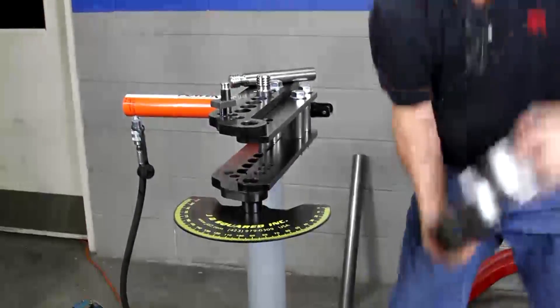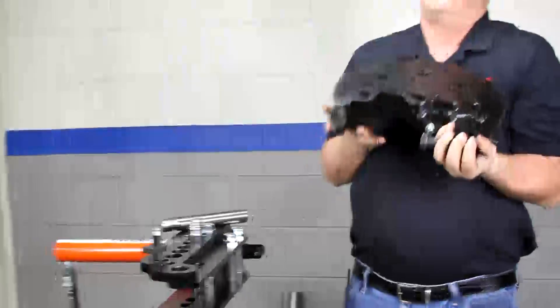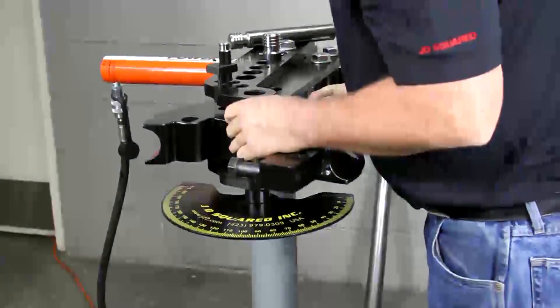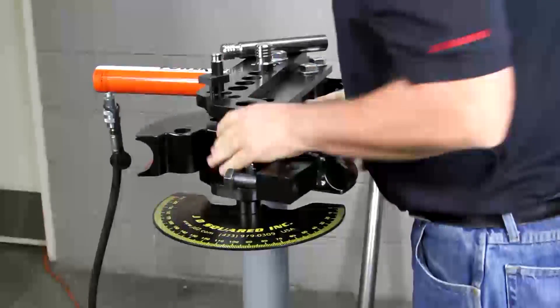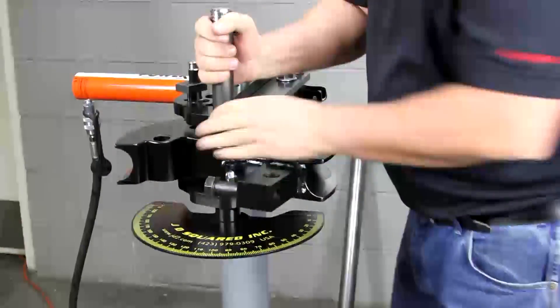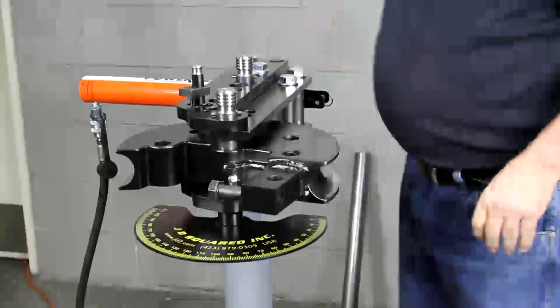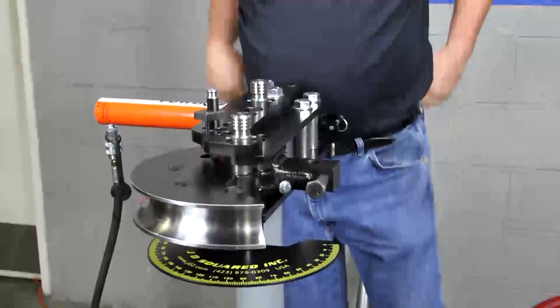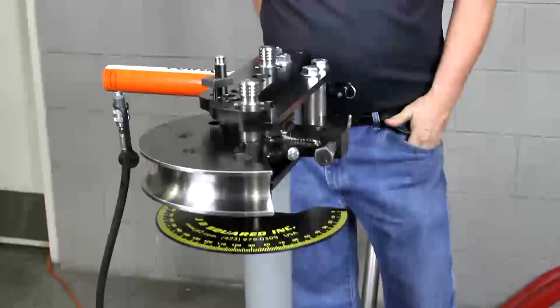Take the pin out. Notice the link's not going to fall out of the die — no big deal. This happens to be a 180-degree die. You can see the kind of quality JD Square prides itself in with the machining right there. Twenty-eight years has pretty much told us how to machine these things and what kind of groove profile to use. A lot of people are under the misconception that a die groove is round — it is not round if you know what you're doing. They're a special profile that helps maintain the roundness of the tubing on the outside while she's bending.